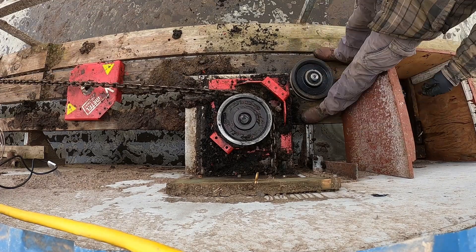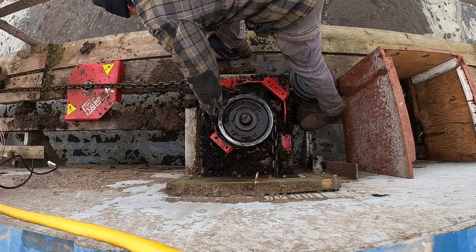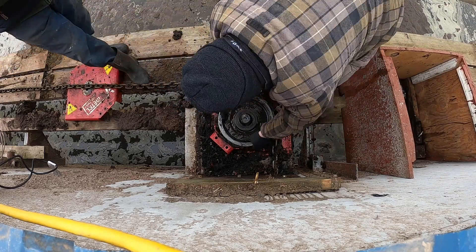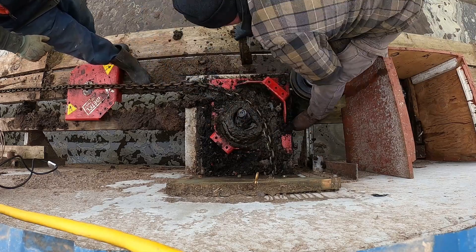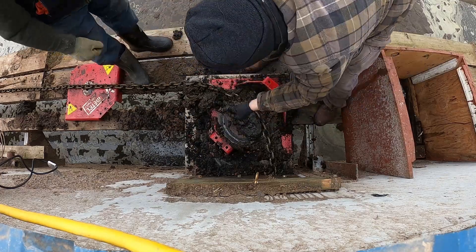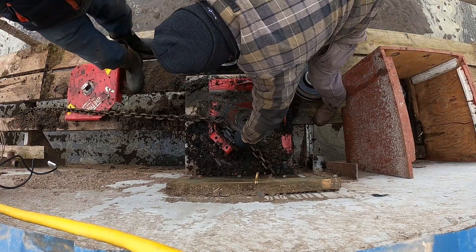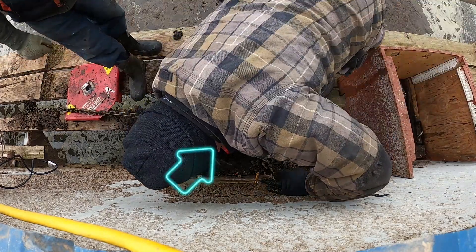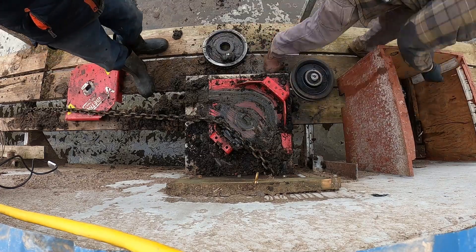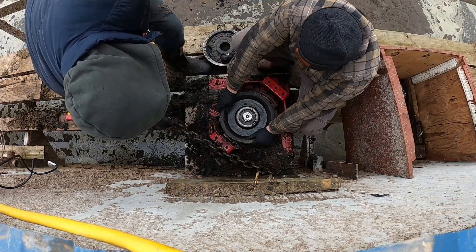Dad's just using the pry bar to take the tension off the wheel and get some slack in the chain. You can see the bearing is completely gone out of the center of this wheel. We're just going to work it out here and get all this extra manure out. The other thing we noticed is there is a bolt that comes through the side — what it does is in the groove where the chain rides, it sticks into that groove, and any excess manure it cleans out so that you don't get a bunch of buildup that causes the chain to twist or pop off.